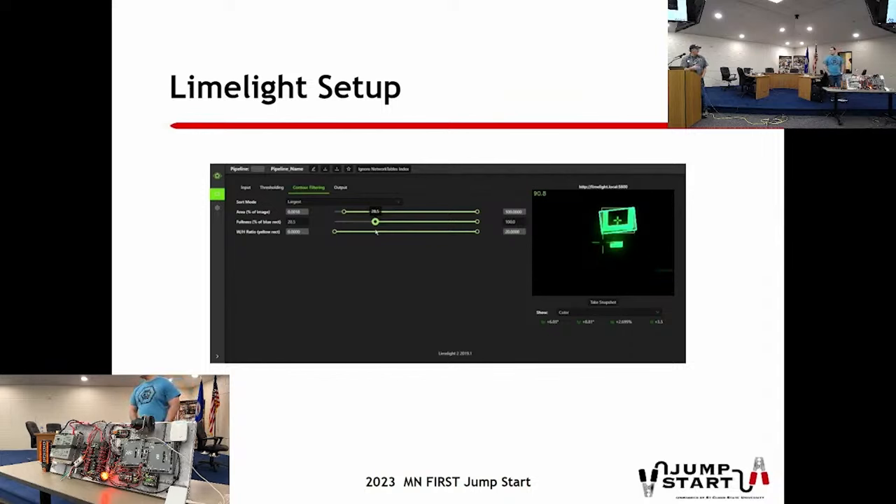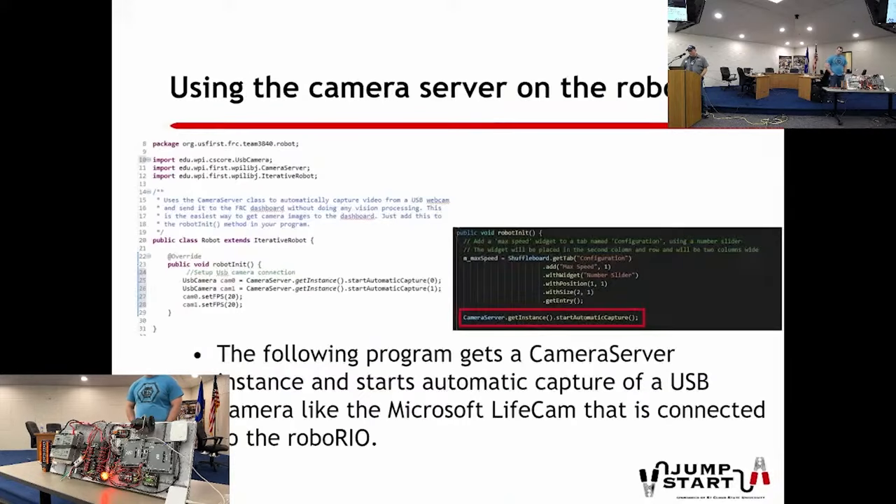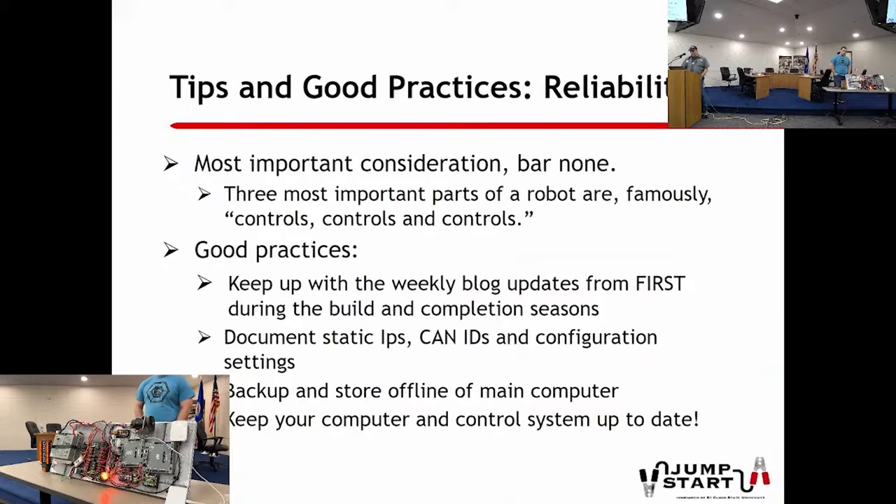The Limelight is another huge thing we've been dealing with over the years. This is one device you will static IP address - it's usually .11 on your robot's network, so it would be 10.team_number.11. There's a whole configuration utility, and Corey Applegate has a big presentation on Limelight. There's a lot of network configuration to do here - you go into the web server to configure it. Don't run DHCP on Limelights as it doesn't play fair on the robot network. There are different code samples available for it.